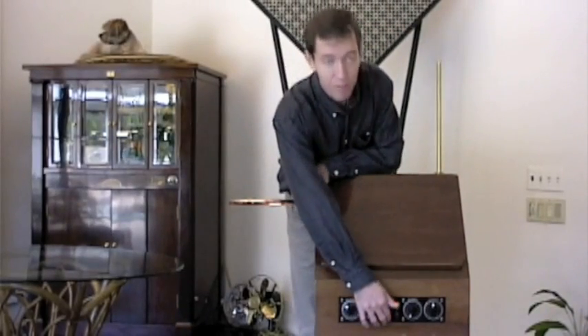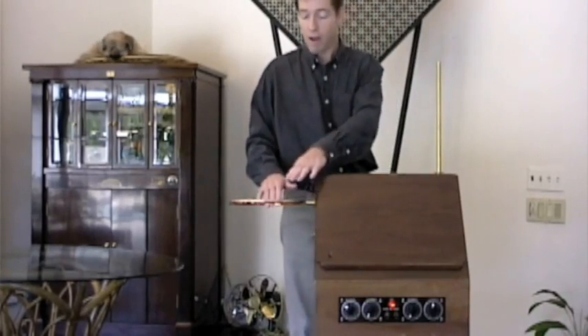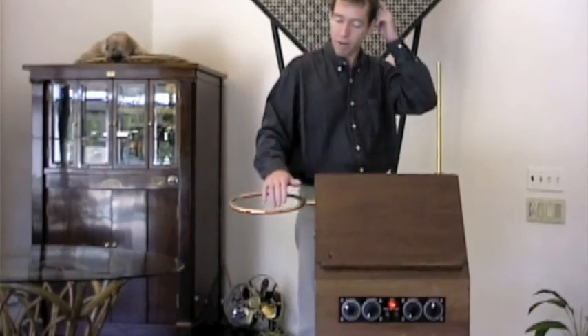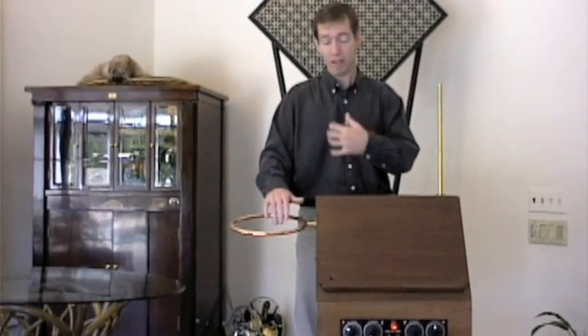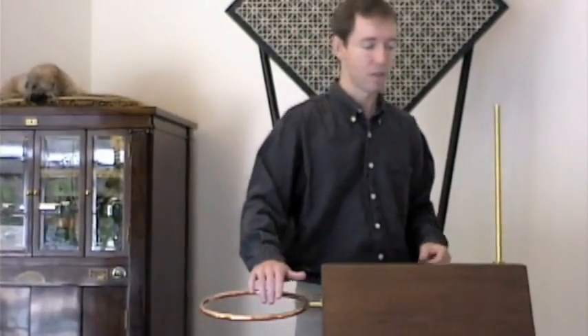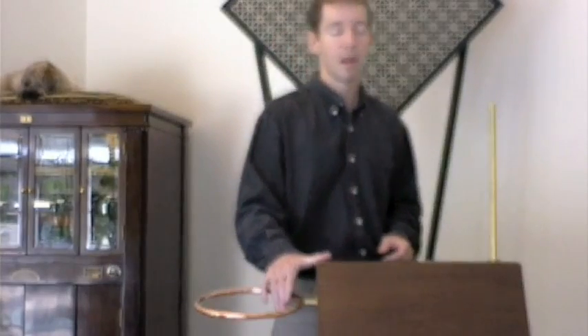So just a quick sound sample and I'll talk about how it produces the tones that you hear. This is the volume antenna — a copper loop that I made. It's sort of reminiscent of what Lev Sergeyevich was doing in the 1920s. For me as a left-handed player, having to stand on the wrong side of the instrument, a round loop is handy because I can reach it as well as a right-handed person can. A vacuum tube theremin has a sound that you don't get from a transistor theremin — apparently transistor theremins cannot be made to sound like this.